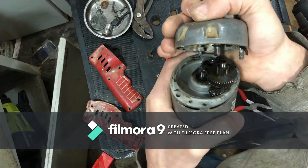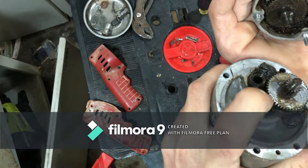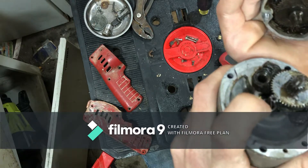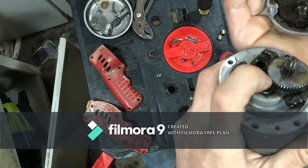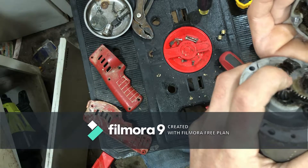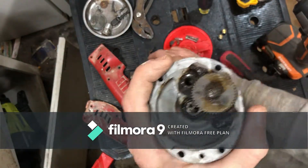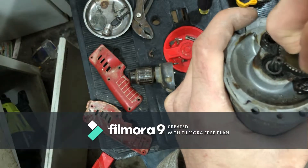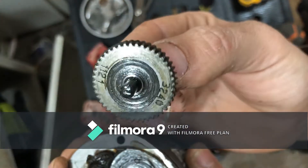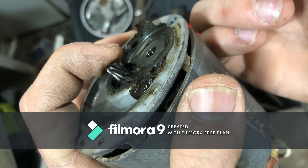You can see our gear reduction in here. It's a helical gear - that's what I was thinking of. Good strong metal gears in there, and they're not powdered metal gears - they're actual full-on gears. You can see they're in real good shape, especially for the age. The edges aren't even too sharp, so it isn't wearing too bad. Pretty nice.